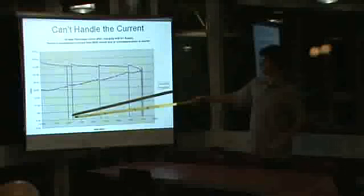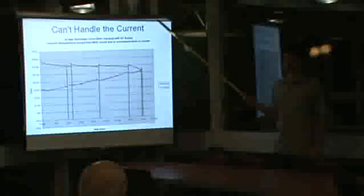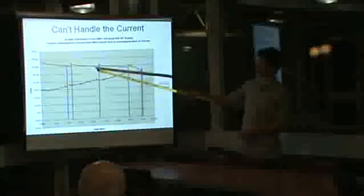So I unplug the battery, turn it back on, get another little bit, turn it down. I just repeated this process, and you can see that eventually the battery gives capacity, but it can't do it at the current that it's rated to give, at least not continuously. But it can for a short time. So if you go up a short hill at 20 amps, you'd be okay.